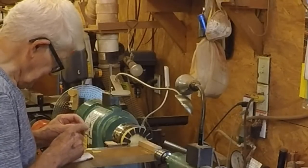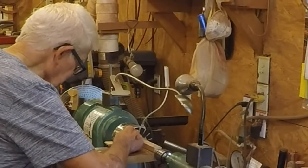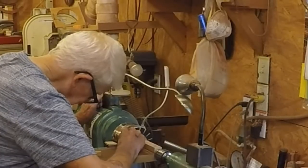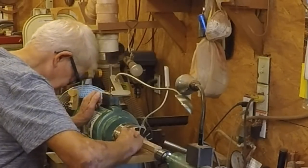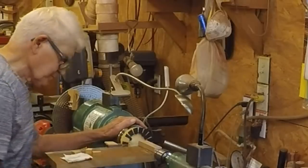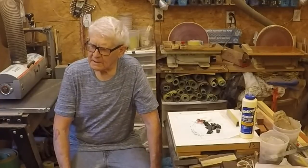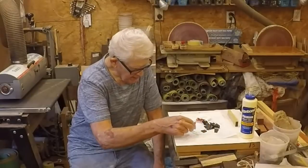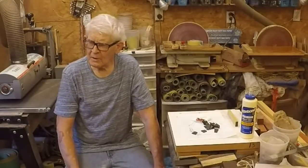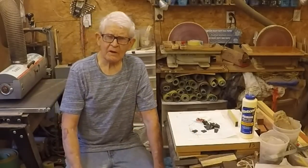Light layer of glue and of course 10 seconds. That's it - it's glued on. Going ahead and do the rest. The yellow heart ring's been glued on and sanded. I got the next African blackwood ring cut, segments for it, so I'm going to glue it on. Then I'm going to glue on one more yellow heart ring and one more African blackwood ring, then I'll be making the solid ring for the top.